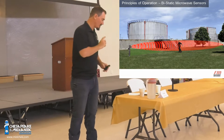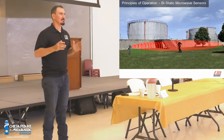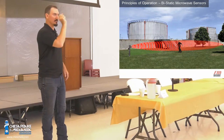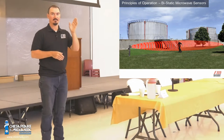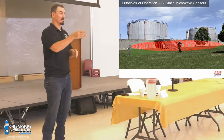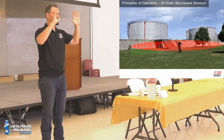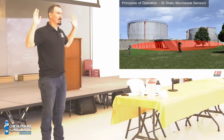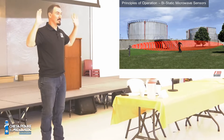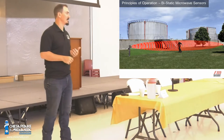When I talk about microwave, I always try to relate it to field of sight — my vision. When I first open my eyes looking at the sun — crystal clear — that's my alignment. The further I get from that sun, the worse my vision. Things start getting fuzzy, then I can't see faces, then it's all peripheral until I can't see my hands anymore. But if I wiggle my fingers, I can see that motion. This area all the way through to this area is a Fresnel zone — F-R-E-S-N-E-L.